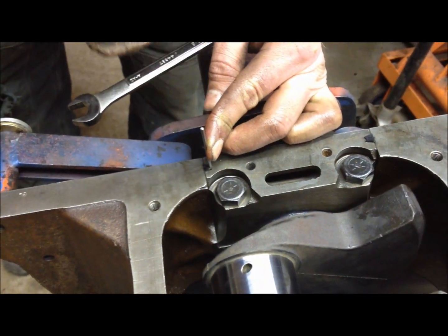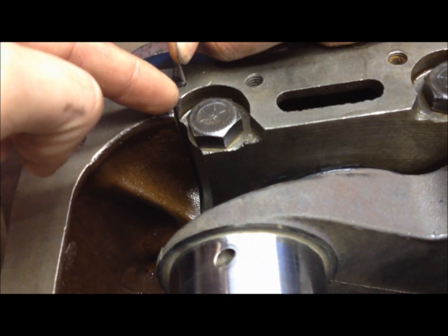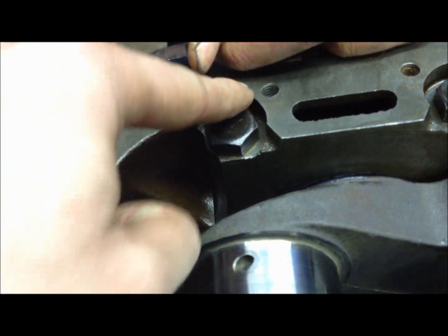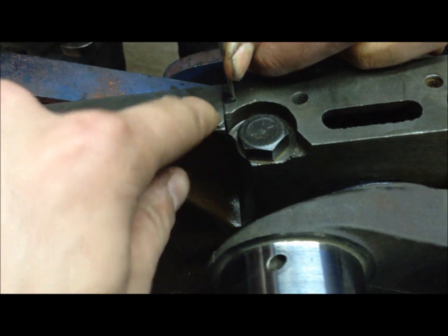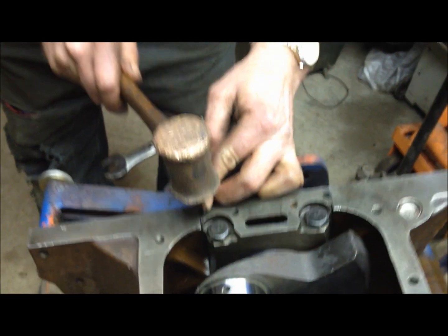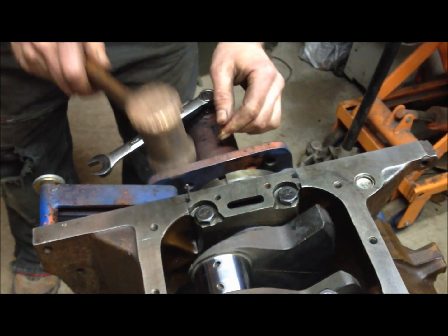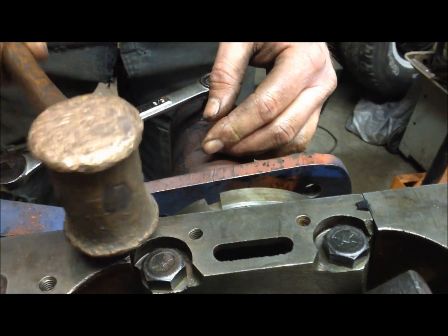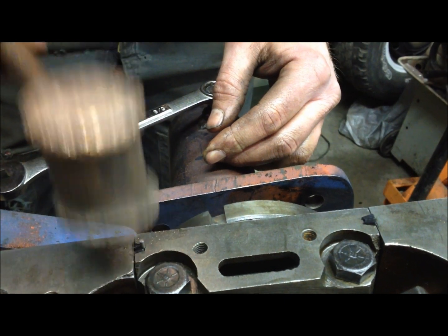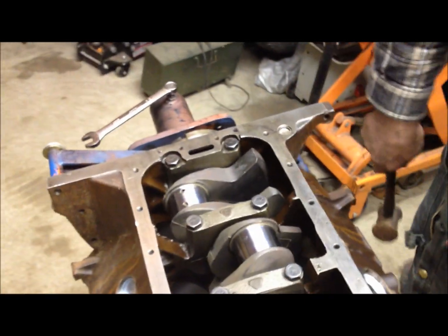When putting in the pins for the side seals, if you've got to go at an angle at all, you want to try and angle them towards the metal, because if you angle them the opposite direction you might drive them into your seal and ruin it. You wouldn't really know until you start leaking oil when you fire it off, so it's a good method to avoid that. It takes a few sharp blows but they should go down flush.